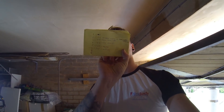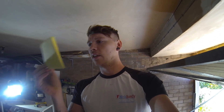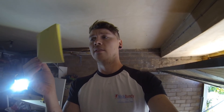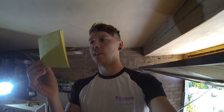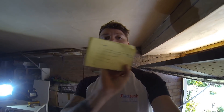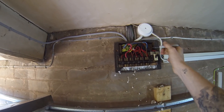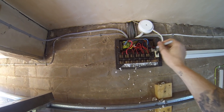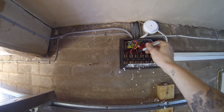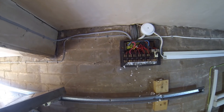The customer had the board labelled up at some point. Number one is nothing, two is upstairs lights and under-cupboard lights in the kitchen, three is downstairs - no idea, guessing downstairs lights. Five is cooker, and six is downstairs ring main by the looks of things. I use my iPad and go across with a sharpie to mark out what's what, doing a notch on one, two, three, four, five, and then six for the ring main.